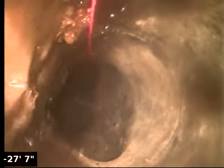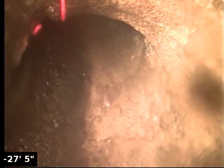Yeah, so this is definitely 6-inch concrete, and we come back. The neighbor's tie-in is likely right there on the bottom side of the pipe. So we got about 28, 30 feet of 6-inch pipe, and we're coming back. This still looks like 6-inch pipe to me. We'll try to identify where the transition is from 4 to 6 here. That could be it right there. Yeah, that's it right there.